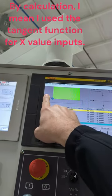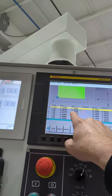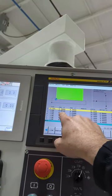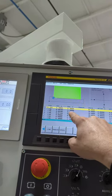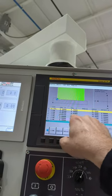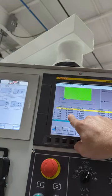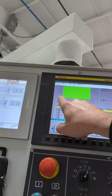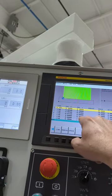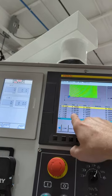And then we go over, and this is just kind of redundant, but I wanted to see it do it. So same X, closer Z, so it's right off of it. And then I go right on the side at zero here, and then minus 73. That should be in the calculation. So then eventually I'll end up at 300 thousandths here, and then at zero on X.